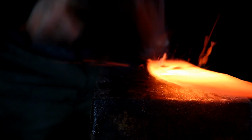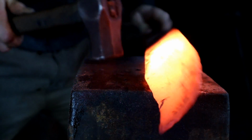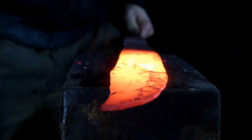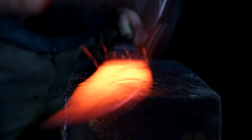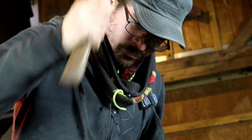With the preform of the blade now complete, it's time to do some hand beveling. The smith must be quite careful in this case, since we do have high carbon edge sandwiched between some lower carbon cheeks to make sure that he forges the bevels evenly on both sides.